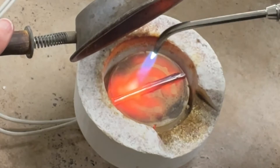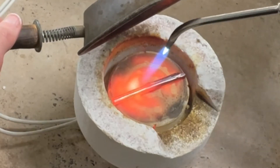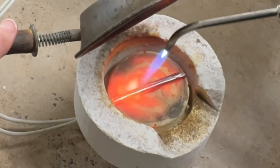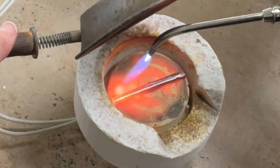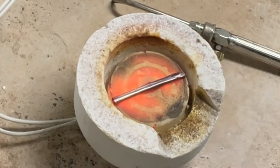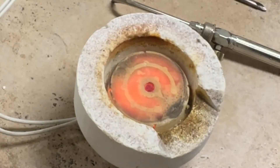How do you know? The gold has to tell you. Do you mind if I guide you a little bit? Okay — hot, hot, hot. Seam is glowing. Let's start right here: flow a little, move it along, flow a little, move it along — and that's probably as far as we can go. Look at that, awesome. So the seam doesn't disappear, but the orange glow part does — that real bright orange glow is the opening. That makes sense, because before I was always like, I don't know what I'm looking for, because the seam doesn't go away in the same way that it does with silver. It doesn't disappear completely like it does with fine silver — it fills in somewhat and gets a little darker. So let's take it out, let it cool and pickle it, and then we'll squeeze together that last little bit on the end and fuse that too.